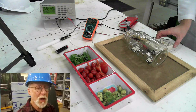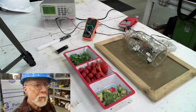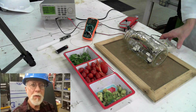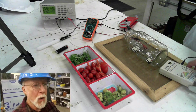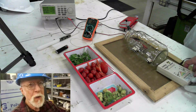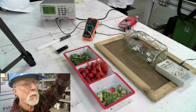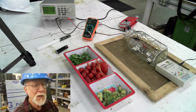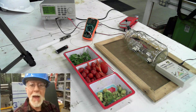So I calculated the amount of force that would actually be exerted on that fitting that's plugging the tube, trying to pop it off of the tube. And I calculated at 1,000 atmospheres, it would be about 24 kilograms, which would be 60 pounds or so. And so I made some hardware. I took two fittings, attached them to stainless steel tubes that were bent into hooks, and I hung one end from a support. And on the other end, I put a scale weight, a basket, basically, and I started putting chunks of lead and cast iron, anything heavy I had around.